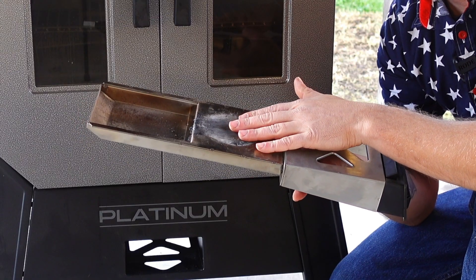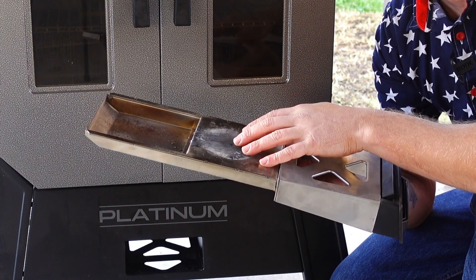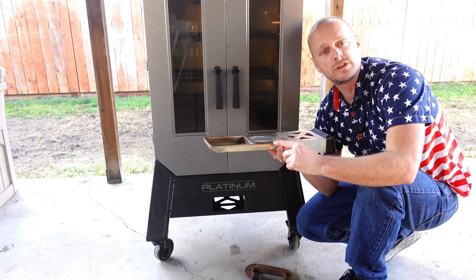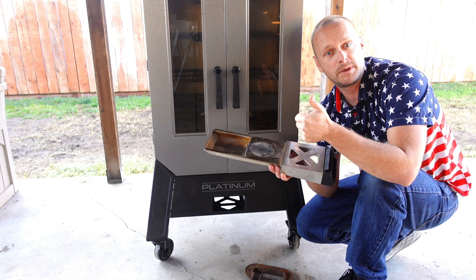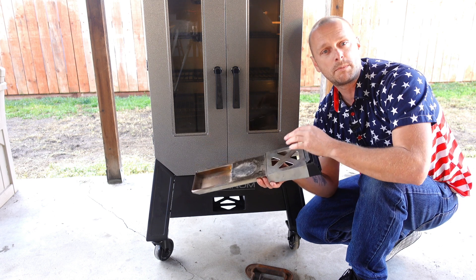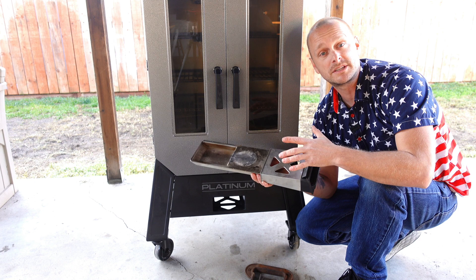This is the floor plate of your burn pot. This plate gets really, really hot — like almost 500 degrees hot. And what happens is the heat is actually starting to warp this bottom plate. And if it warps up, it then becomes very difficult to slide in and out because the warping is binding the pull-out tray, and that's what's causing it to become stuck.